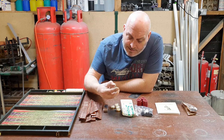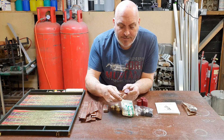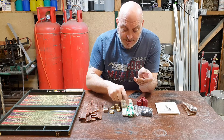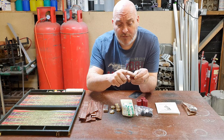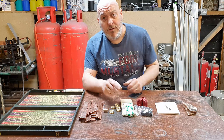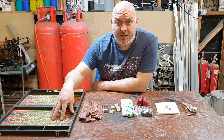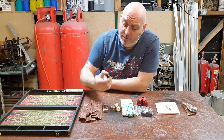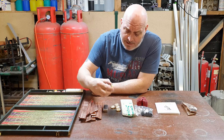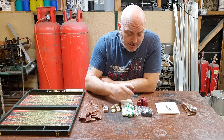When I made the first set of counters there was a little ridge on the inside underneath, and when it comes out on the counters it doesn't look great. So I'm going to take this Sculptex clay and run it in this little groove here to smooth the backs off. Because once the board is cast and the patinas are on, they're going to be quite fragile — protected only by a layer of lacquer. I don't want sharp edges on the bottom rubbing away the lacquer layer, so I'm filling all the grooves with Sculptex clay so the bottoms are nice and smooth after sandcasting.